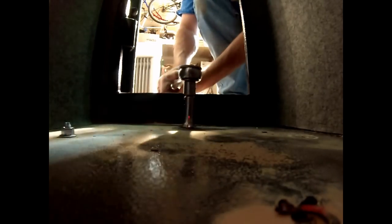You'll know when they get tight and they're not spinning in there, because that can be the number one thing. You can see how this one didn't catch until much later than that one. Sometimes it pulls, sometimes it's just pulling the whole thing up until it catches properly. If you have some issues with that and you can't get it to seat right, you probably over-drilled the hole, which could be a major problem. You may have to relocate or move that safe over and try a different hole. That's going to be one of your problem-solving tips.